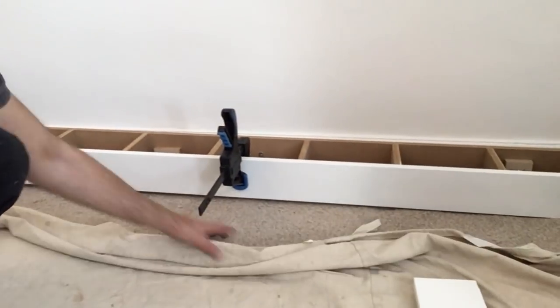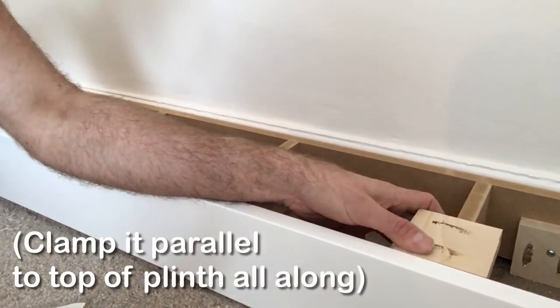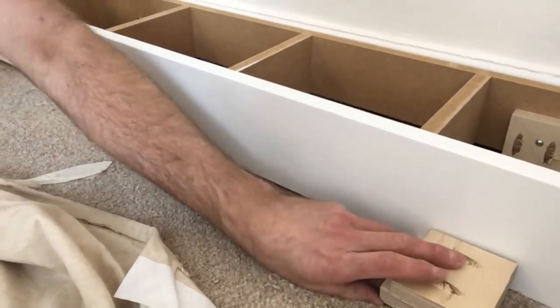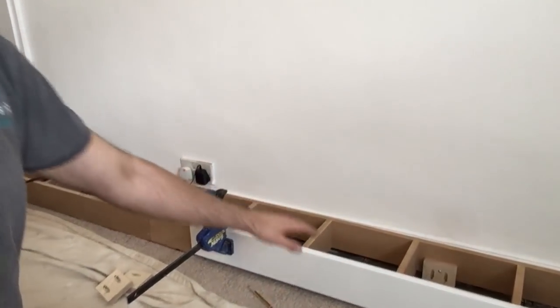The scribing method is to clamp the plinth fascia at a measured distance — I've chosen 36mm, just because it's easy to do with two bits of 18mm — so I've clamped that projecting above the ladder plinth by that amount. I can then scribe a line with a little bit of pressure on the carpet, putting a pencil just above those two blocks, which draws a line all along. I've already checked it doesn't run off the thickness of the board, because we've put enough scribing allowance on. Once I've scribed that line right along, the fascia will be able to drop down by that measured amount, which will bring it flush with the top of the ladder plinth and give it the profile of the sloping floor at the bottom, fitting tight to the carpet.